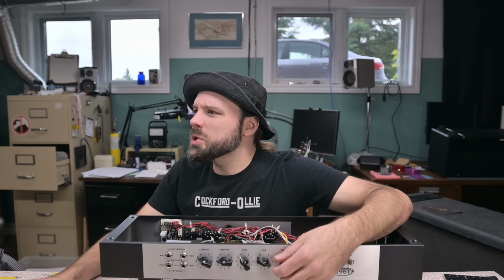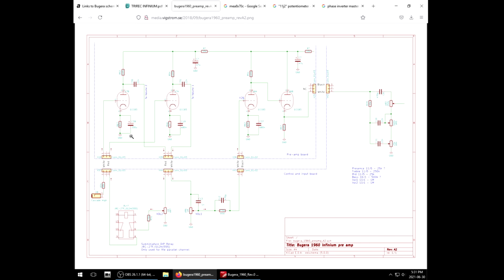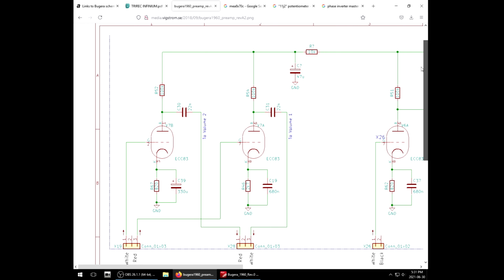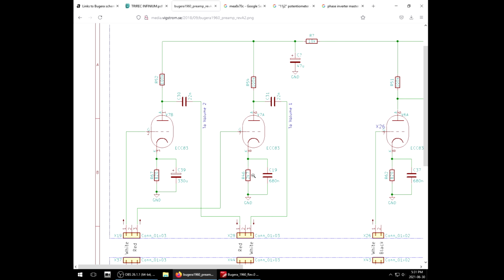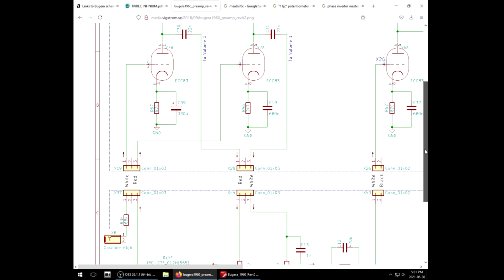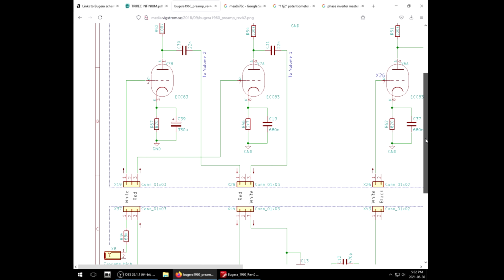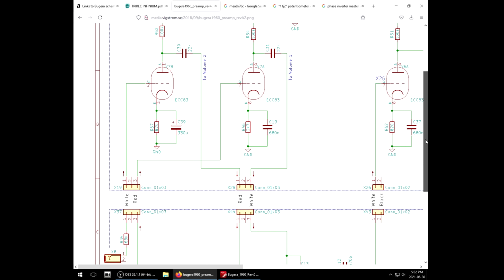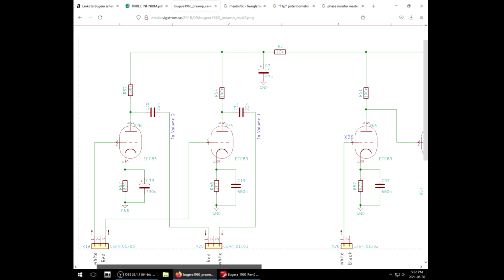This one is more specifically going to be this schematic here. So we'll take another look at what's going on here. This one updates the bright channel to the 2.7, the correct 2.7. Okay, but then it also claims to have a 22N here, then 022, not the 0022. So that is a little bit different if this schematic's accurate. The thing is, this particular schematic is fan drawn, if you will, user drawn. So it could be inaccurate.